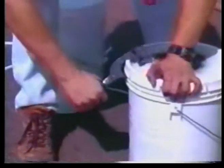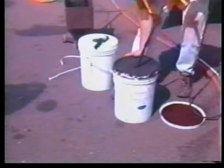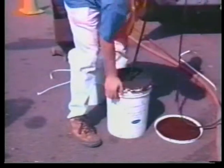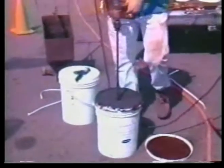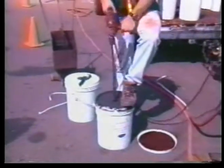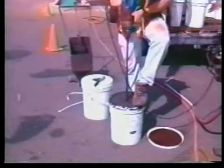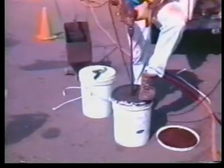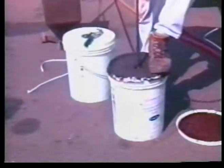Once the wire is in place, it's time to apply TA-500 loop sealant. First, stir TA-500 with a drywall paddle mixer and drill. Pre-drill a small hole in a bucket lid to prevent the sealant from splattering. This lid and mixer assembly is kept with a bucket of water for use the next day or the next loop. Stir TA-500 for 10 to 15 seconds. It should have a smooth, even consistency without lumps.